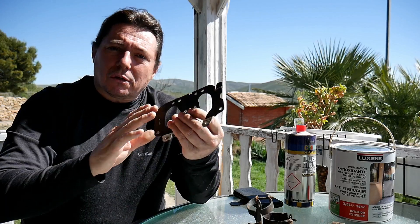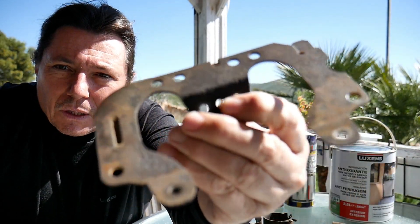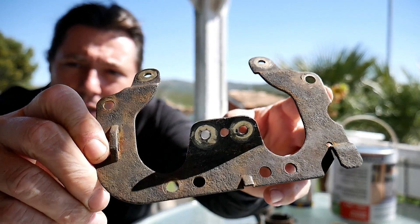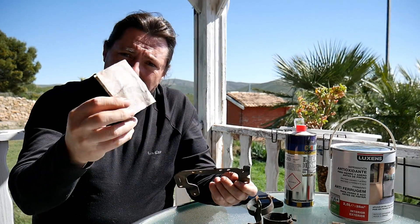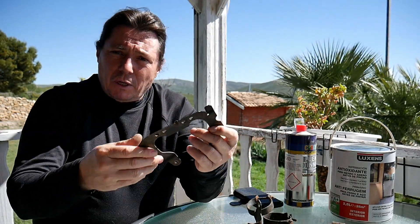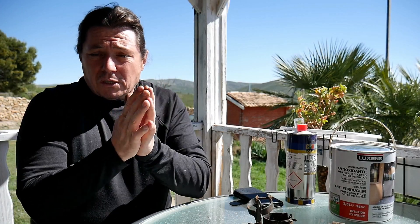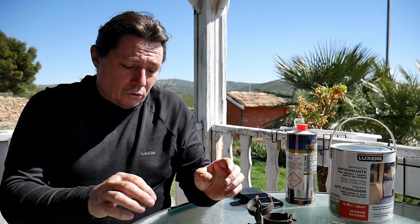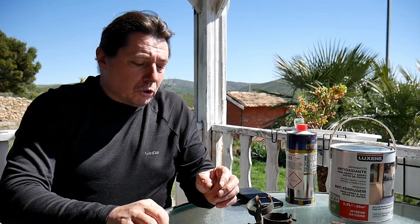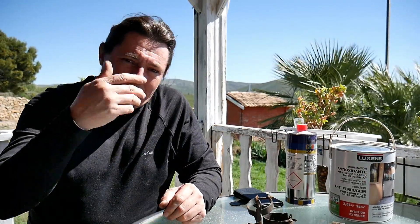Before, there was a crust of rust on it — and now look at that. I'm very, very, very pleased. That's the way it looks now. When you've got your part like that, you take a bit of sanding paper and sand the part everywhere. Then place some dissolvent to clean it nicely. At that stage, wear some gloves because you don't want finger marks on your part — when you paint later it will show. Then to protect it, place an anti-rust paint and you'll be good to go. Your part will be okay for many, many years.